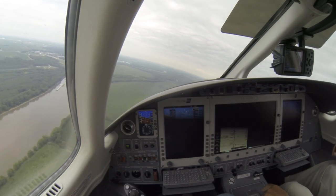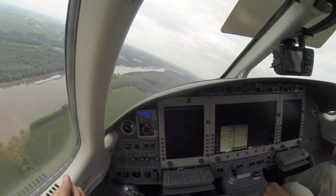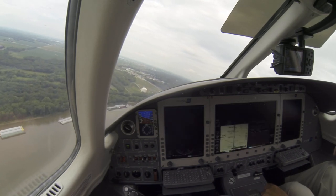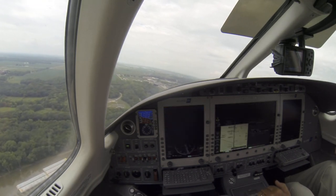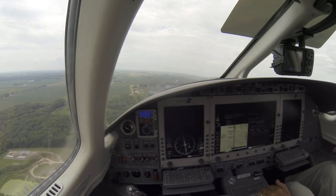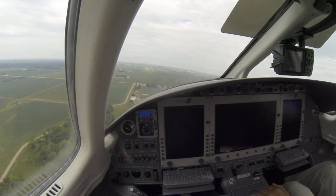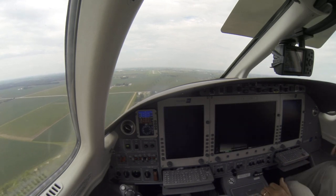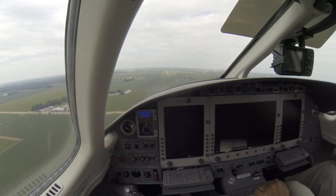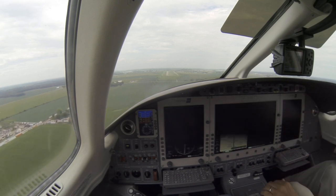So do you understand what the failure is, why it's failing? There's more force on one flap than the other. And how does the computer determine force? I don't know. Amperage to the actuator. Okay. So it reads the amount of amps going to each actuator. And if the amperage difference from one actuator to the other is different beyond a certain value, that means one actuator is getting more power, i.e. it's being asked to move more lift or move more force, and it's basically saying, hey, I don't like that, something's wrong, like a track is busted.